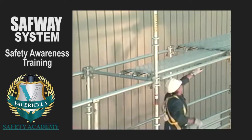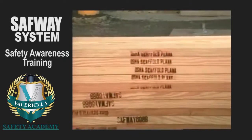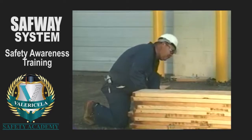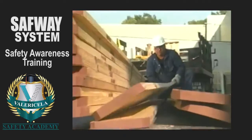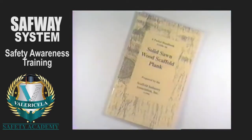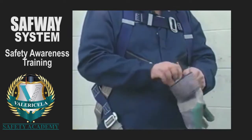Metal hook-on scaffold plank is normally used with SafwaySystem scaffold. However, if solid sawn lumber is used for planking, it must be graded for use as scaffold plank. Prior to use, inspect each plank carefully and remove any plank containing defects such as saw cuts, notches, dry rot, splits, discoloration, chemical or acid contamination, or those previously used as sills. The Scaffold Industry Association Handbook for inspecting solid sawn wood plank can also be used for reference. Finally, make sure that the erectors are wearing the proper personal protective equipment.